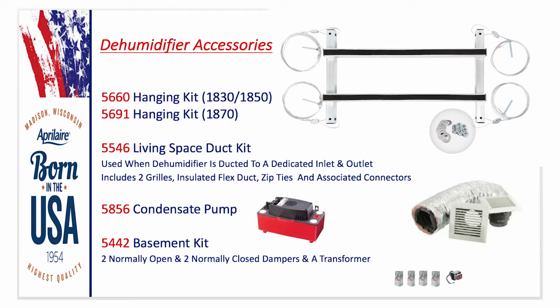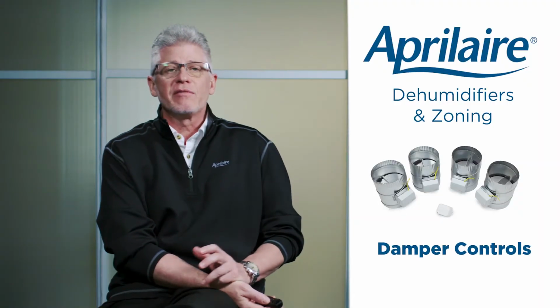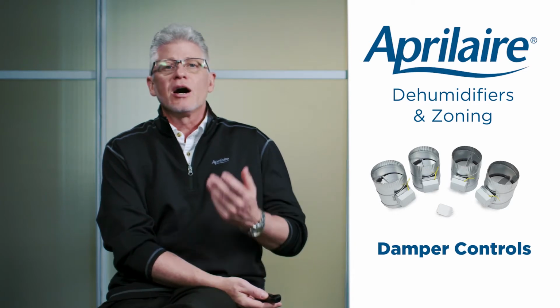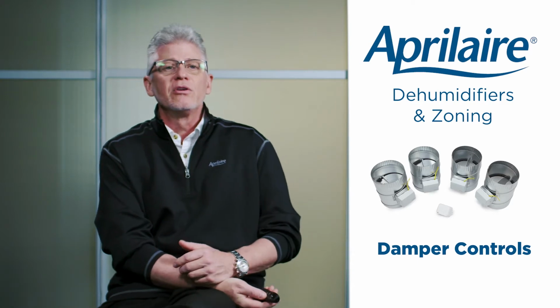AprilAire also offers a Model 5856 condensate pump, and we also have a basement kit which will give you 2 normally open and 2 normally closed dampers and a transformer. Remember, the AprilAire dehumidifiers have the ability to open and close 2 different sets of dampers. Therefore, they can be zoned. You can do an upstairs versus a downstairs, or you can do a crawl space versus the basement. So it's a really neat product.